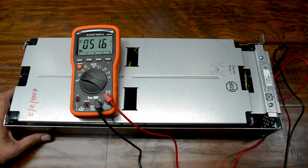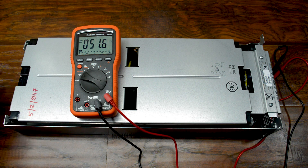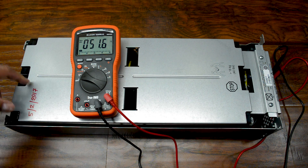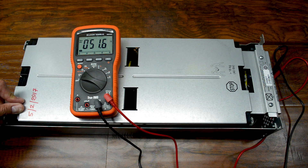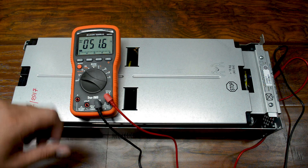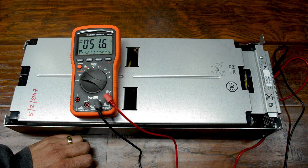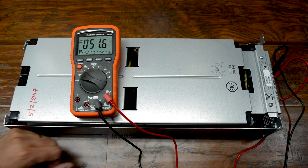A few remaining things to do before I get this in the rack. I put the cover back on and screwed it down. I also wrote the date down on the cover — this is the installation date so that hopefully, not for another few years when I go to replace or service these, I'll know exactly when I put new batteries in the UPS. And I've got my meter up here measuring 51 volts, and this should measure about 48 volts on the way out. So I think we're within tolerances and things look good. I feel pretty confident that I've got this wired up right.